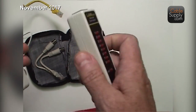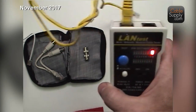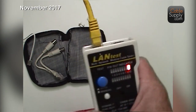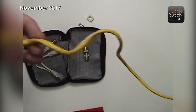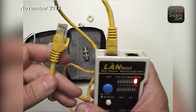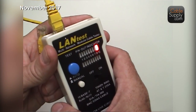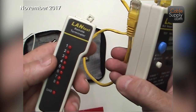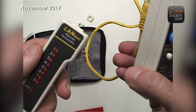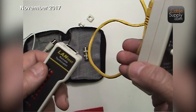There's no battery in the remote unit — it's self-contained. Pretty sturdy plastic. When I test things, I always keep a short patch cord. I keep maybe a one-foot patch cord plugged into the rack that holds the patch panel, and then I go out to the office area — or have someone go out — and plug in to check our cabling in the wall.